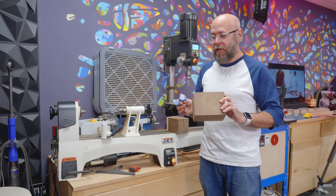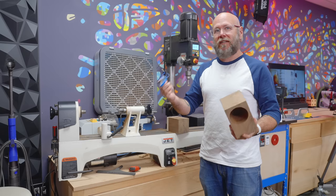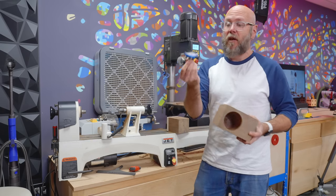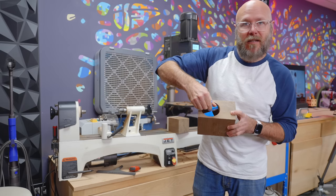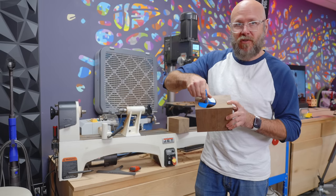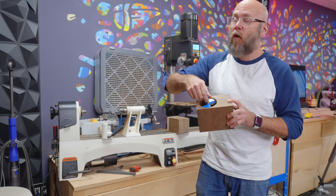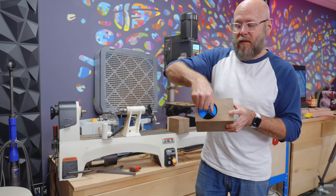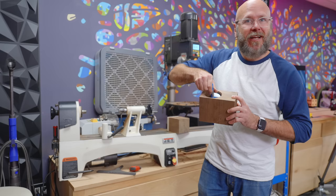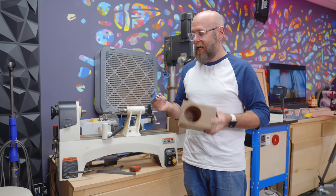Or if it's just because we're going into hard end grain — I'm assuming it's because we're going into hard end grain. I'm going to chuck this up in the lathe and see if it's a different experience, because there was definitely some run-out on there and it's possibly just my chuck, hopefully not the drill press. That bit shouldn't wobble that much, so I'm going to try it in the lathe.